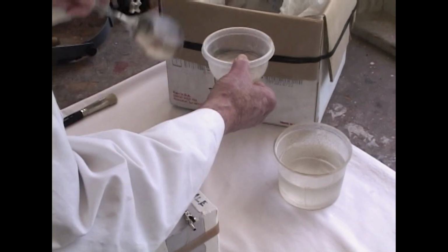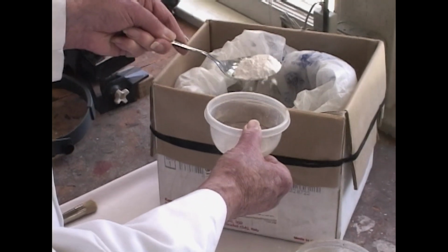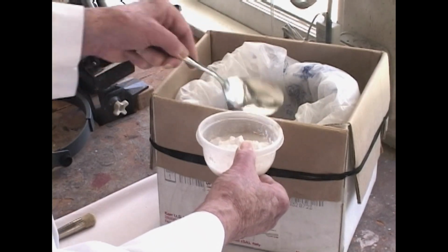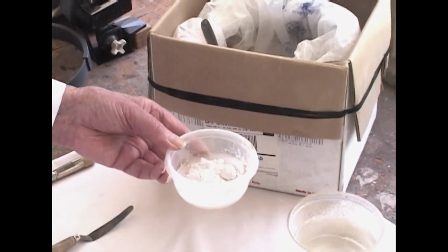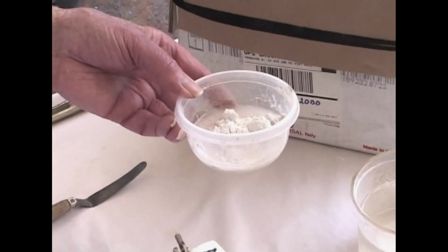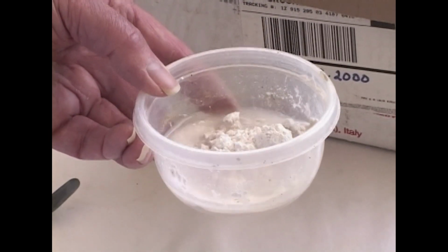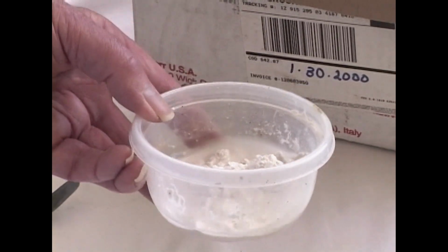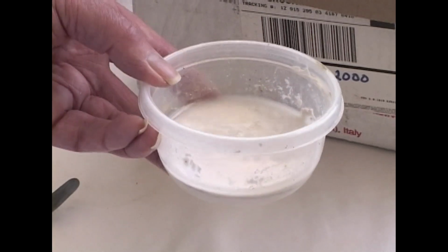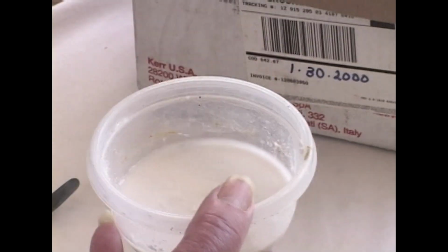And then we begin ladling our Velmix into the water. We put this in the water and let it sit until it saturates the little mountain that's been created. We're not stirring it around. Martha Armstrong Hand, a master ceramicist and mold maker, taught me something about mold making that I'll never forget. As soon as our little mountain is thoroughly saturated, there it is.